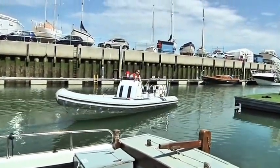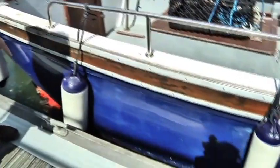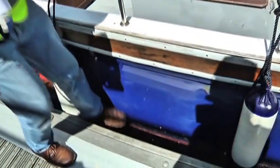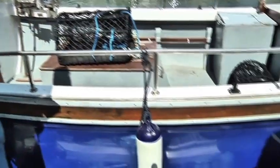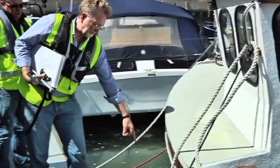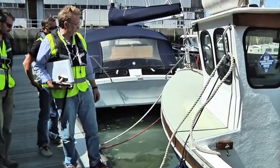What you would need to be doing is imagining that that deck is the deck that we're measuring to, imagining that there are some scupper drains along the side here, you'd be measuring to the scupper drain about there, down to the water, which would be the deck height, and you'd be getting a freeboard to the lowest deck. You'd then be coming to this raised foredeck area, you'd be taking a measurement about halfway along the raised foredeck down to the water. From that, you'd work out an average freeboard.